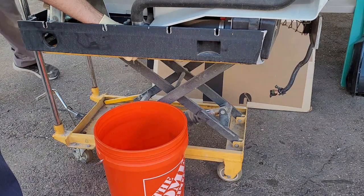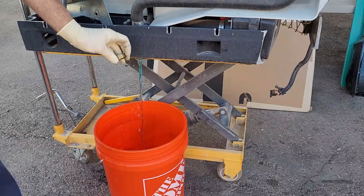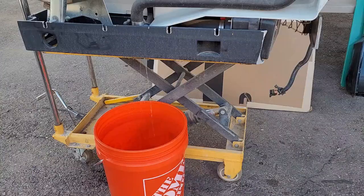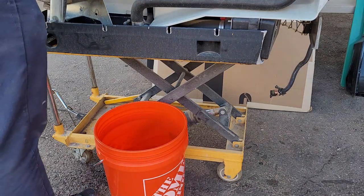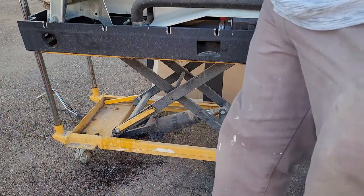So I'm going to pull the cap on the drain. Drain out all the coolant. What's left of it? I think there's going to be a lot, right? You didn't see the giant puddle of coolant. Well, why would I see it? When it came off the wrecker. So I think I disconnect the exhaust right there. What do you think? I think you disconnect the exhaust. That'll free that guy up.